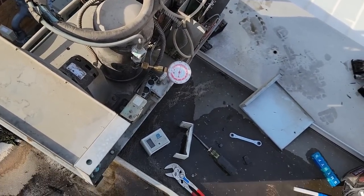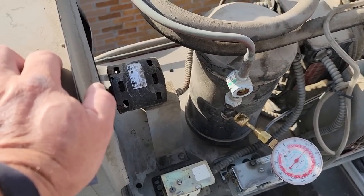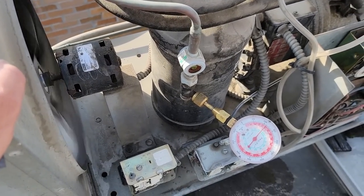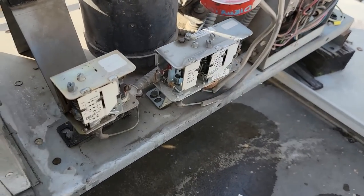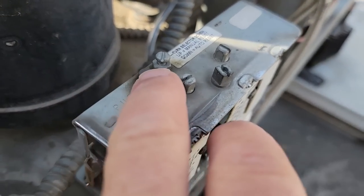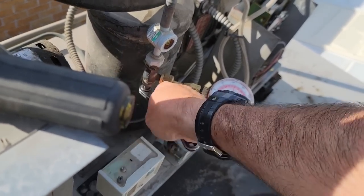Evaporator's clean. What I think I'm gonna do, get that motor ordered, get a new one, I'll put some oil in it for now to keep it going. But I have my lingering doubts about that pressure control. Why did it reset one time and not the next? So I'm really thinking it may not be a bad idea to replace it too. You can see that button there, how much it vibrates. Not looking very good. But we're gonna go ahead and replace this pressure switch.